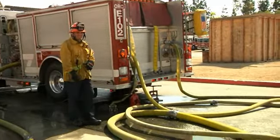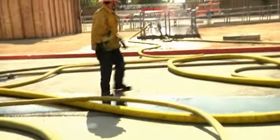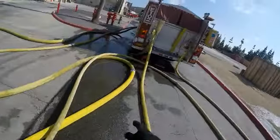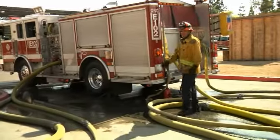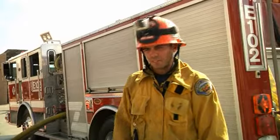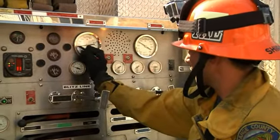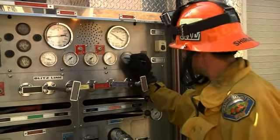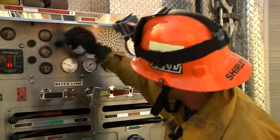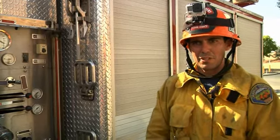Once I've got my second line in service, I'm going to come back and check my lines for any kinks and look for any leaks coming out of my rig. Any minor kinks I'm just going to kick out. I'm going to check under the rig and make sure I don't have any excessive leaks — if I did, I would address them. Once I've done that, I'll acknowledge my proctor and call time on the event. I'm going to go back to my pump panel and mark all my gauges. I've already marked my static compound; I have very little change in my residual, so I'll put a second mark. I'm going to mark where all my discharge pressures are, then check all my other gauges — oil pressure, water temp, oil temp, and volts. Once I've marked my gauges, I'm going to go through my shutdown procedure and cleanup.